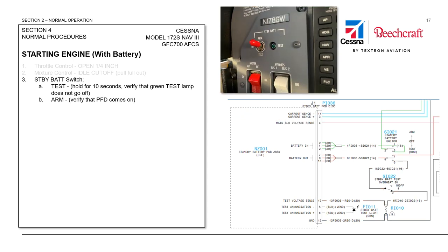We will then move the standby battery switch to the arm position. This will direct current through the standby battery switch through the PCB and back out, this time going through the other side of the switch towards the essential bus. This will power up some of the basic Garmin essentials, including the primary flight display and the Garmin engine airframe interface, so we can get system indications for verifying the rest of the system through the engine start.